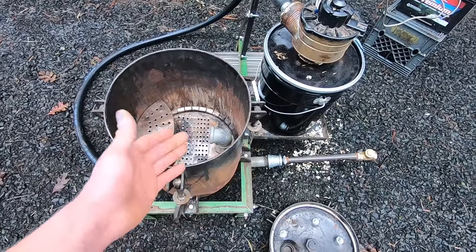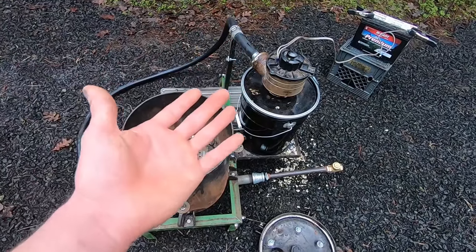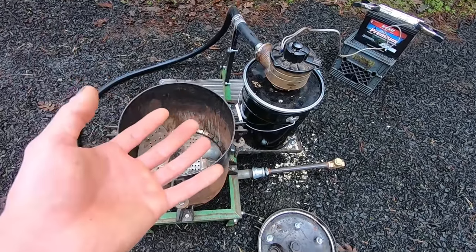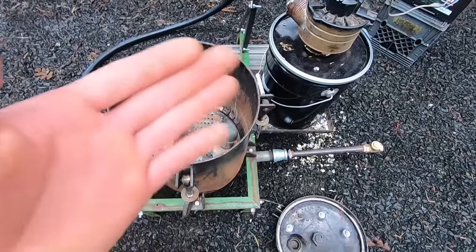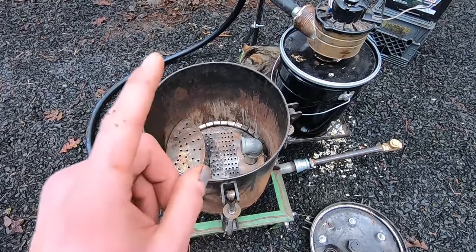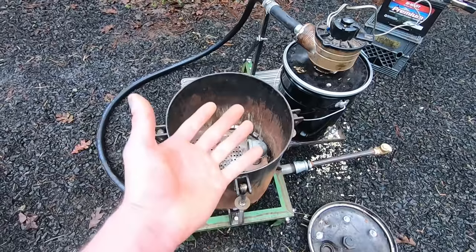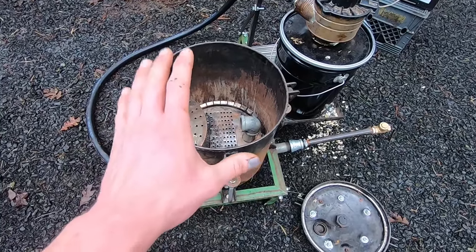These devices are taking advantage of a process called gasification, in which you can take any kind of organic biomass, really anything natural that burns, and by heating it up, you're able to break it down through a process called pyrolysis to its basic elements. When you do that, you create a gas called syngas, or wood gas, or synthesis gas, or whatever you want to call it. And the gas is about 20% hydrogen, 20% carbon monoxide, 50 to 60% nitrogen, and the rest is just remaining methane. So again, that's whenever you heat up biomass above, I believe it's about 451 degrees Fahrenheit.